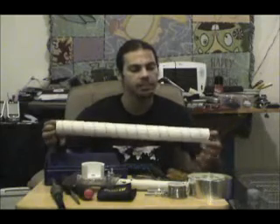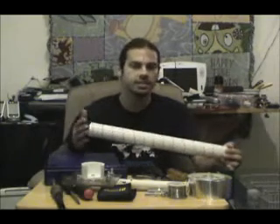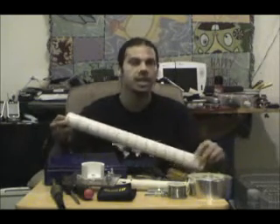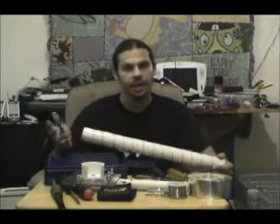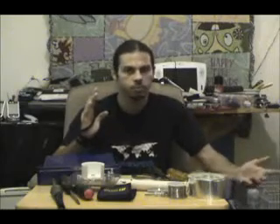This is pretty cool because this type of antenna is really good in a cityscape like New York City where I live. Every single time a radio wave reflects off of a metal surface, its polarization will shift 90 degrees. Every 90 degree shift, you can lose up to 3 decibels of gain. So if you have a dipole antenna that's vertically polarized and your radio wave is bouncing off of metal surfaces — scaffolding of a building, siding of a house, a metal mirror — radio signals are constantly bouncing all over the place, shifting its polarization.